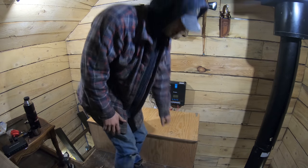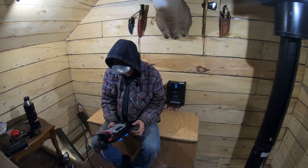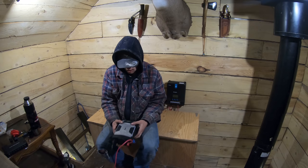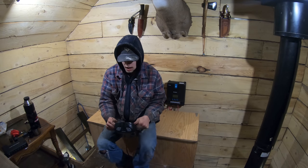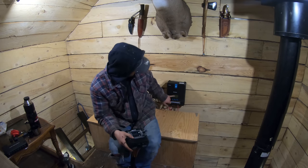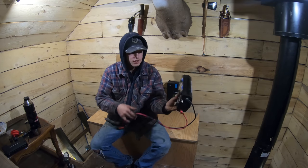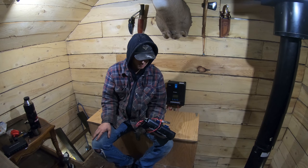I'm not having a good time here. I tried to hook it up to my battery bank and it would only read 9.1 volts, beeping constantly. Hooked it to the old battery and it was fine. It was sensing low voltage but everything's on 12 volt — all my lines — so it makes no sense. I'll have to look into that. I don't have a good explanation and can't do research out here in the bush.